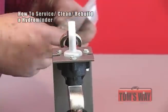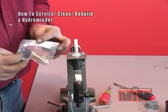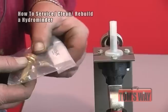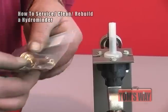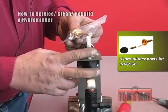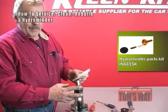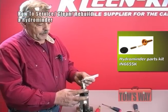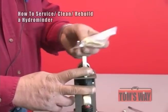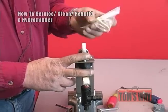When you're going to repair this and put a new kit in, you're going to get a plunger assembly kit — part number IN6655K. It comes with everything you need. The difference in the newer ones is they come from the factory with a plastic stem, but the repair kit has a metal stem. They're the same — but metal stems actually hold up better than plastic ones. So you're better off putting the metal stem in when repairing. Don't reuse the old parts; replace everything because it all comes inside the kit.